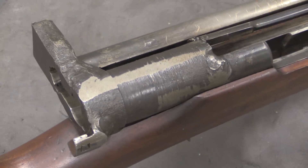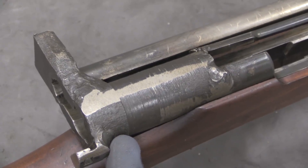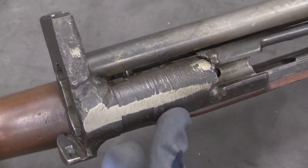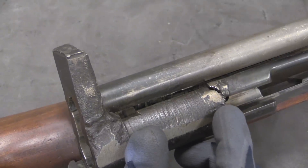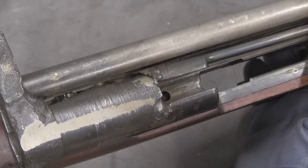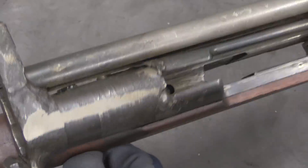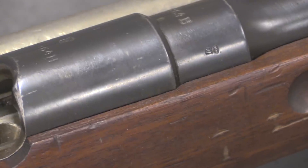With this type of conversion it's necessary to extend the back of the receiver to house things like the recoil spring and cover the rear end of the bolt's travel. And weirdly, the conversion work on the bolt was excellent, but this extension is really, really remarkably crude. You can see right here where it has very definitely cracked in half. But it's been tacked back together, and my assumption is it probably wasn't heat treated when it was re-welded, and it cracked on the first firing. You can see up here the original serial number and proof marks of the Mannlicher rifle that this was built on.